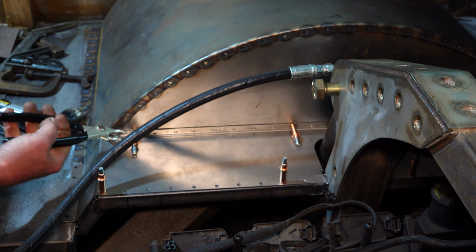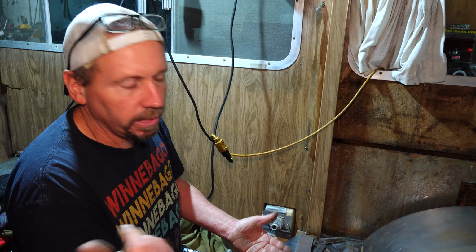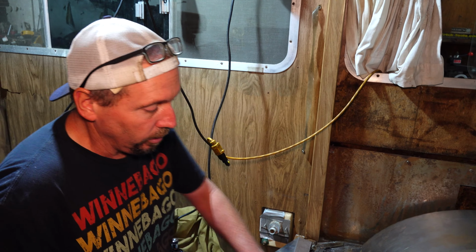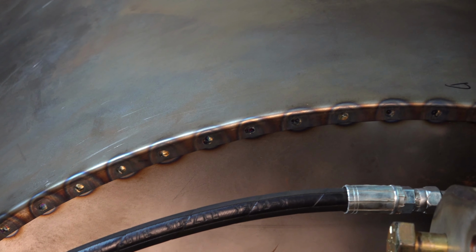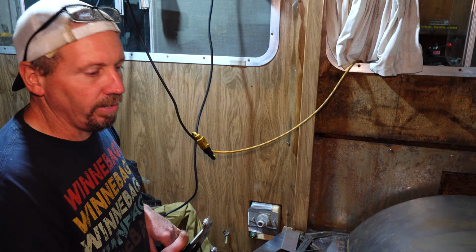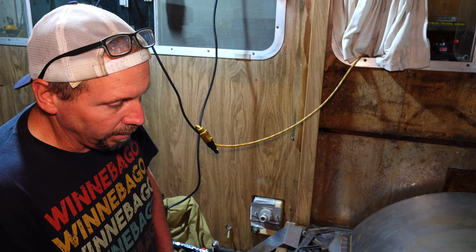But for what I'm gonna do, after I'm done welding all the other holes, I'll take it out, and it's got a hole on both sides, but I can still plug weld it with the TIG welder. I'll be able to fuse that hole up, and then I'll be able to weld from both sides. So those will look just like the other plug welds, but I can hold it in place while I'm fitting everything, because you don't want to start welding and have things start pulling, so you want to make sure you have it all in perfect place before you start putting any welds on it.